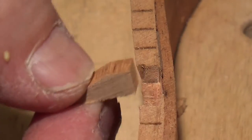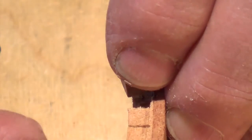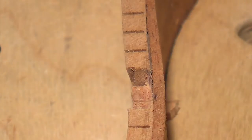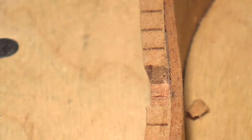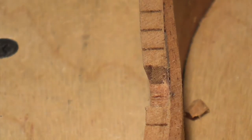So you can see I took one piece of kerfing. I can stick it on here and I can see how that fits. Right now what I'm doing is I'm trying to get an idea how thick I need to make this. So I can take a chisel, cut that off. I only need enough to go in here. So I'm now going to cut this off again and give me a little bit of room for adjustment. I have now created a little wedge that will fit right on here.